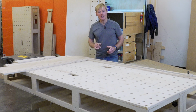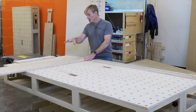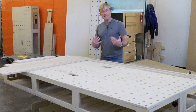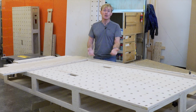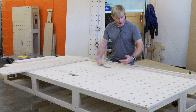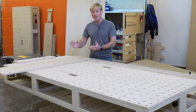Now, some of the shortcomings of it were, it's a two-piece tool. So I had the crosscut section, which was clamped or put down with bench dogs, and then the rail for squaring to this and the dimension. The dilemma was I would set it up for cross-cutting, but once the operation of cross-cutting was done, I needed to remove it because this track, this T-track, acted as the rail to square. So the material would go up to this and butt up into the stop. And then with the track on here next to the bench dogs, that would give me that perfect square.